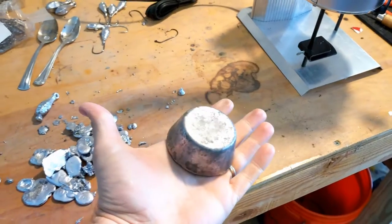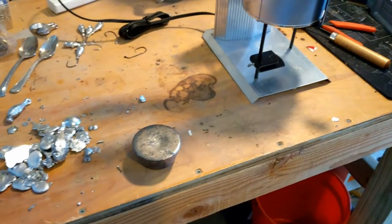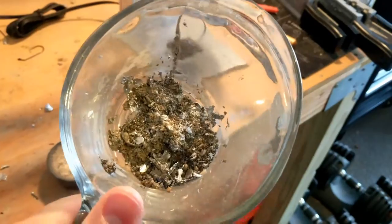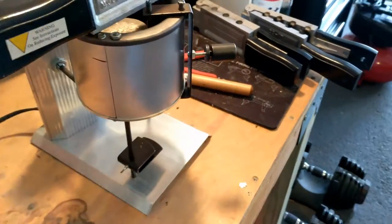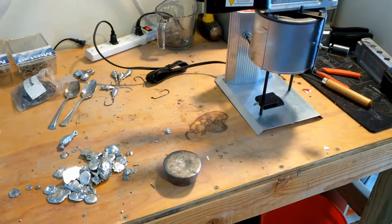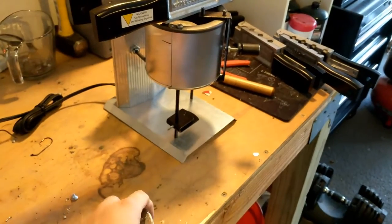This lead here consists of two-pound ingots - I have two in there and one more to add after it starts melting. These have been triple fluxed. Fluxing is when you add a little bit of wax to the hot pot - it smokes like crazy but brings all the impurities to the top. You scrape those out; if you pour with any impurities in there it makes little valleys and dips, different colors. You want them to hold together well because you're going to be powder coating these.